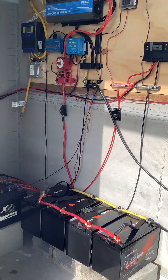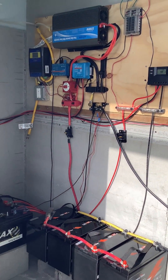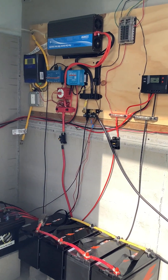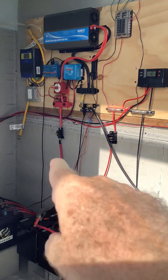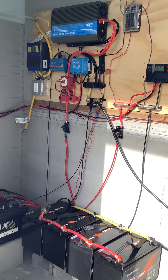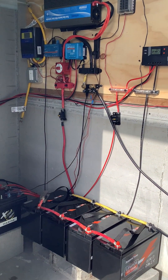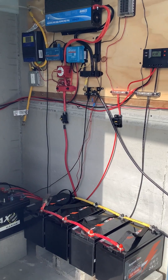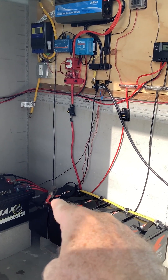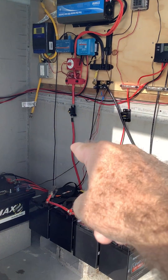The batteries in turn go back up and feed this inverter, which is rated for 2200 watts with a little bit of a spike. Since the inverter will do 2200 watts, my cables coming off the system — the positive and the negative — are 1 AWG, which will allow for 1920 watts or 150 amps. With that many amps coming through, the system is fused here at 175 amps and has a breaker right at 150, so the wires are never overloaded.